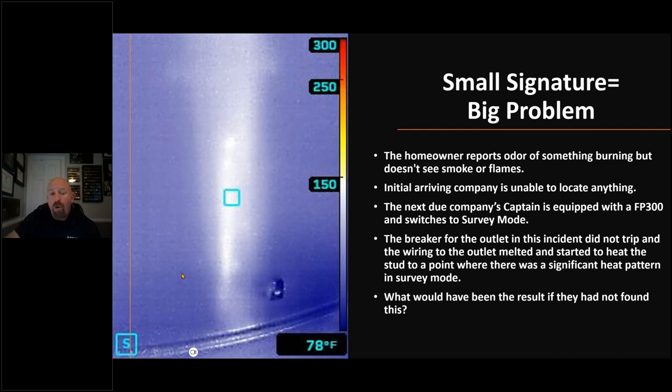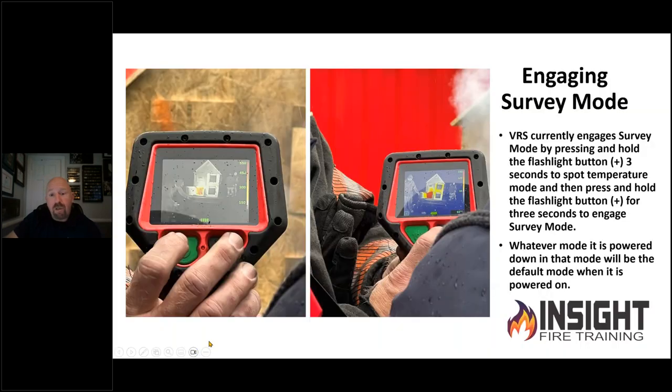Think about responding to a homeowner who has a problem — maybe a mom home alone while her husband's at work — upset because they smell something burning. You go through the house, you look, you check everything, and you say everything's fine, call us back if you smell anything else. Three in the morning, they don't call you back — the neighbors do. And now they're trapped on the second floor of their home, pinned down by fire. And we failed them. I'm not telling you you're going to see every problem, but I consistently see we don't do due diligence when it comes to this. Make sure you understand that these subtle heat signatures — especially in a lath-and-plaster wall — are a big problem. Get your education and training. We offer all of that for free online. We partnered with Seek Thermal to produce even more free resources like what you're watching today, so you can be what we call intelligently aggressive.